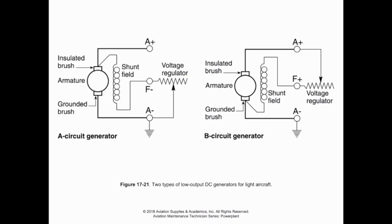using a shunt winding. So we have three types. Remember, we have a series generator, which is not commonly used, but is much more often used as a DC starter motor because of the high initial starting torque. Just as a refresher, as the motor starts, we're going to have a very high inrush of current, which is going to get the motor spinning. However, that current is going to decrease over time because as the motor spins, it's going to have more EMF resistance built up between the armature and the coils. It's going to try to act like a generator because it's rotating now, so we're going to get a little pushback, which means the current that moves through the motor is going to decrease a little bit.